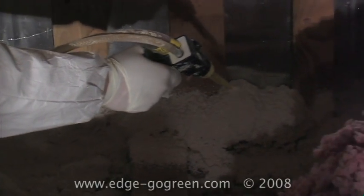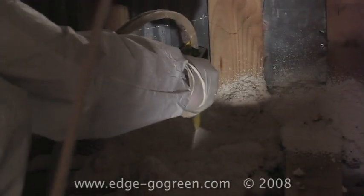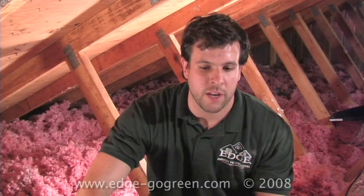And as you see with this dirty insulation here, air will still move through it, and as it does so, the insulation will act like a filter, trapping this pollution, pollen, mold, mildew, other sawdust, and building byproducts within it. Of course, this air leakage drives thermal inefficiency in the house, provides convective pathways for heat loss, and also drives indoor air quality concerns because you don't want to be breathing the stuff that's up here.